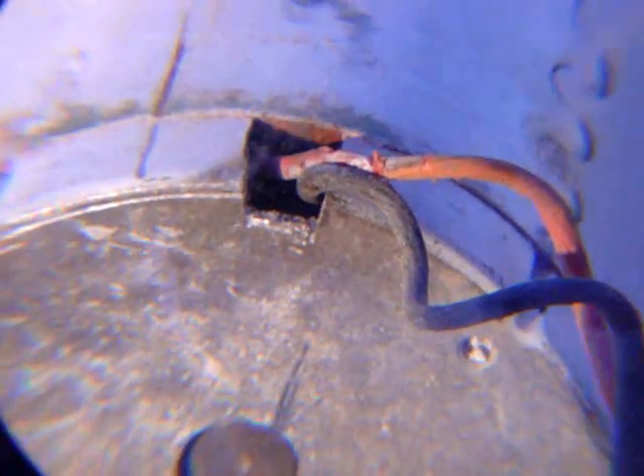It doesn't look too pretty, and there's a little one on the black wire as well. I'm going to throw some heat shrink over both of those after I put some silicone on them. Then I'm going to silicone the hole up. When I put it back in I've got a hole here and a hole over here and a notch right here — I'm going to put one screw behind this and one into this notch. That'll keep it from twisting from here on out, and then we'll be okay. I'm Scott Brown with Green Wind and Other Home Energies — many good things to you and yours.